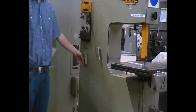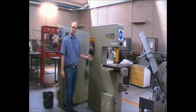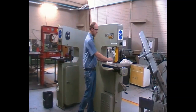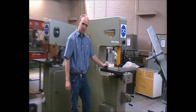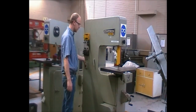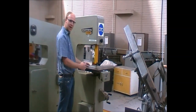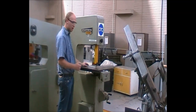The off button also acts as the emergency stop of the machine. If the machine is doing strange things or making unusual sounds, please call one of the instructors to have a look. Make sure the blade is tensioned correctly and not loose, the blade is still strong, and the blade is sharp. Then we will continue with the cut.